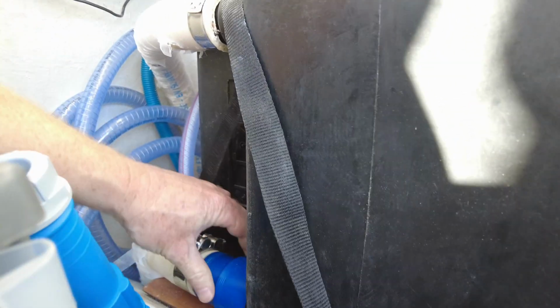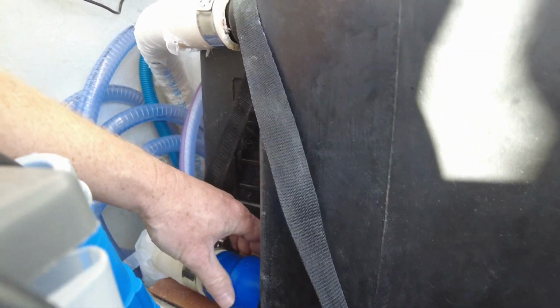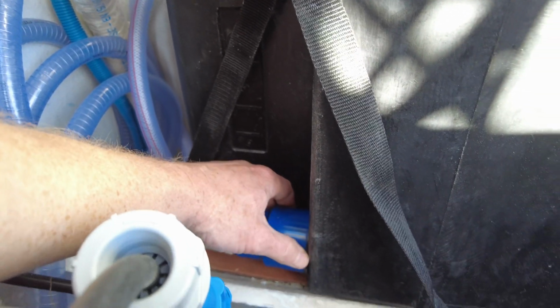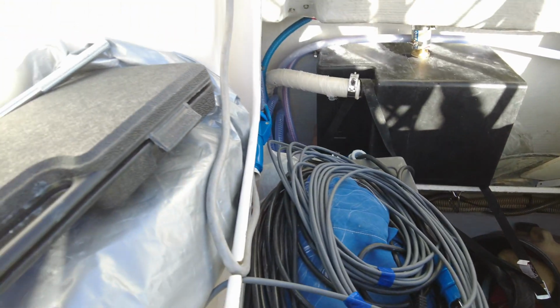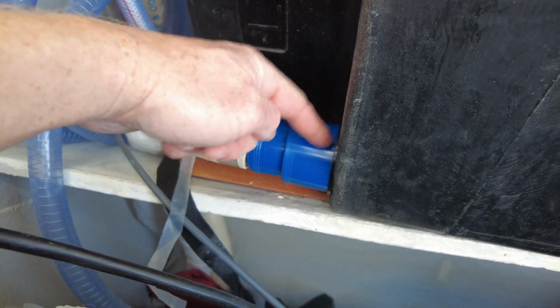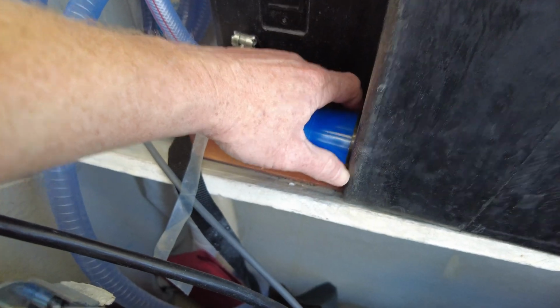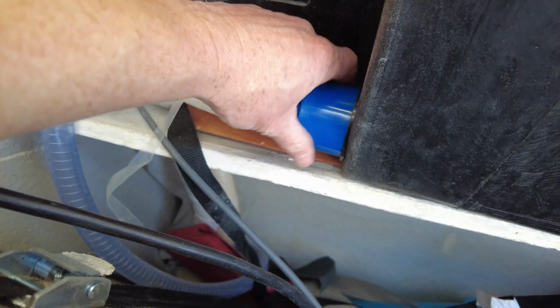So I have a little leak just in here, and that's because this hose is pushing the tank just this way, and there is this gasket here, and most probably just over here the water is leaking. So I'm going to put some Teflon here. Let's see. So here to the thread I put a lot of Teflon. I put this rubber gasket here and made it really strong.